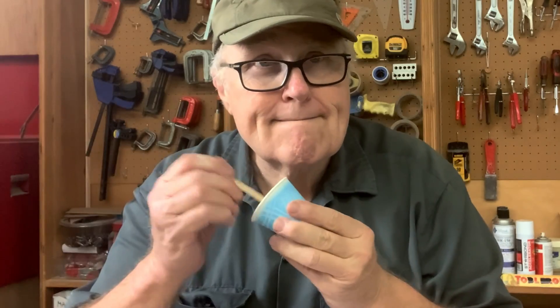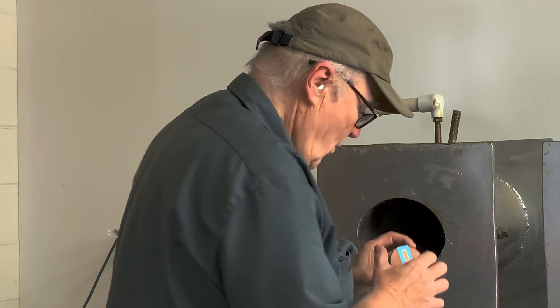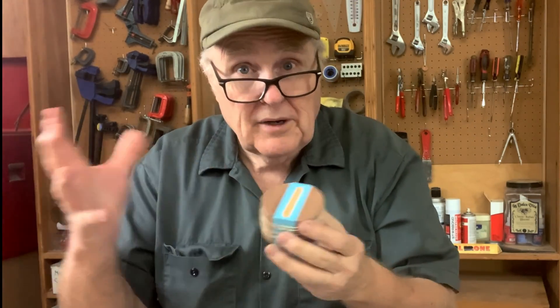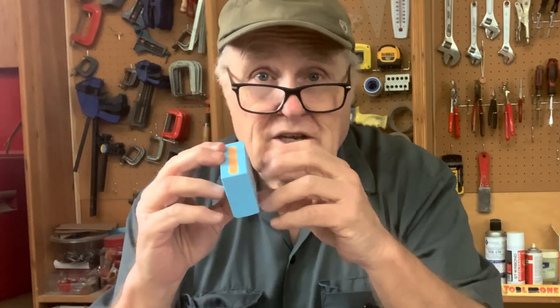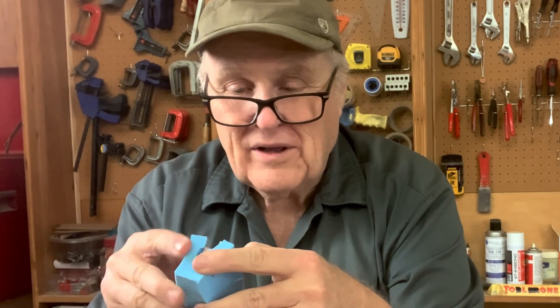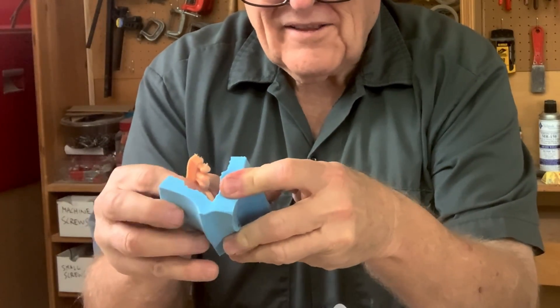It's time to check the witness cup — seems like it's ready to go, let's pull it out. It feels pretty hard, but with really tiny parts like this they tend to take longer to cure than bigger parts — generally speaking, the larger the part the quicker it cures. We're going to be careful extracting these. Remember, they're all attached to that single bar, so they all have to come out together — they can't come out one at a time. The thing I'm worried about most are the fingers — teeny tiny little fingers. The feet are wanting to stay in there — oh, look at that!